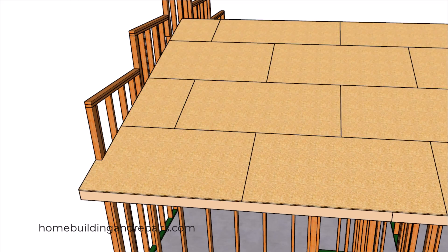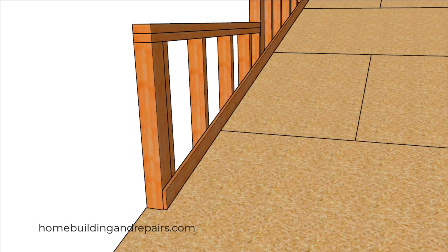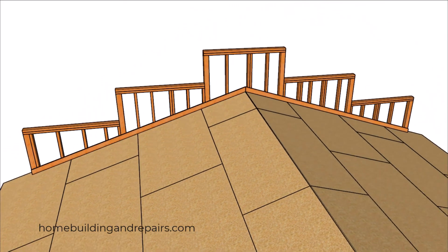Let's go ahead and install our roof sheathing. Once we nail the sheathing to this backing board — which is nailed to the wall framing studs — we're going to get a pretty good connection. Then let's install a 1x4 for our z-bar backing, which will help with the roof flashing. I'm pretty sure I have other videos on z-bar installation.